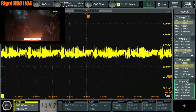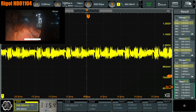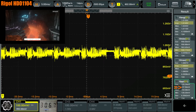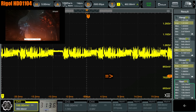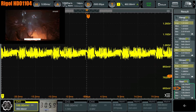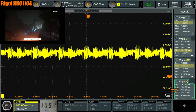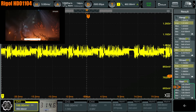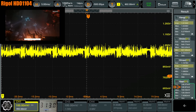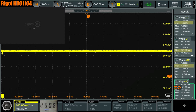For comparison, the GTX 1080 Classified, which I measured in the previous video, was getting an average peak-to-peak of about 240 millivolts at the same 5 milliseconds per division timescale. So this looks like it's absolutely blowing the classified PCB out of the water — but that's because there's a ton of V-Droop relative to the classified PCB. So this doesn't actually really count.